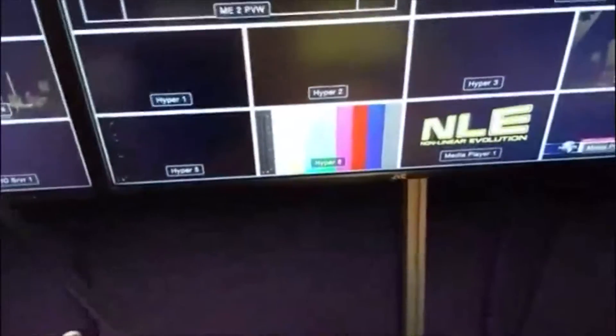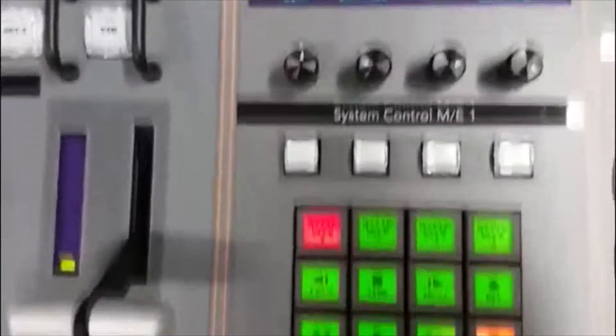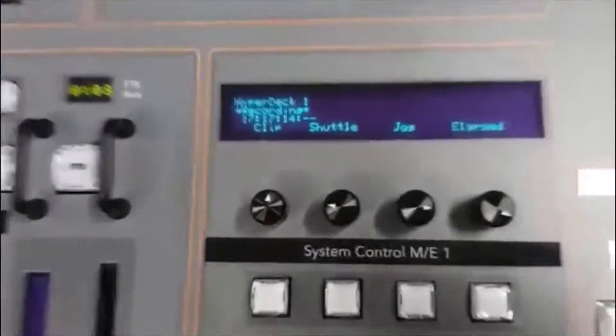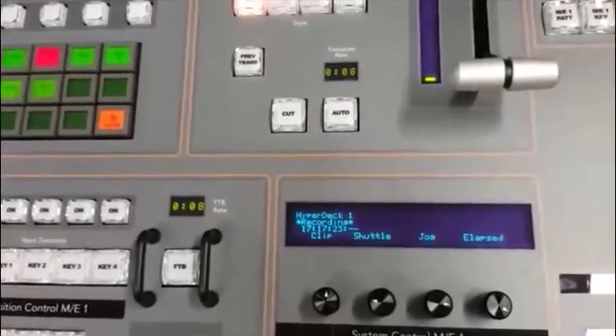It's flashing because we know it's on one of those inputs above number 20. Over there on the HyperDeck 6 preview window you can see we've got color bars. So in order to record, we know we've got something going to the HyperDeck now. Go down to the system control panel, push HyperDeck — our only HyperDeck is selected — and if you want to record we just push Rec. You can see the clock is going, so let that run for a few seconds; it's recording color bars.